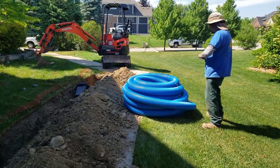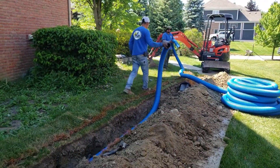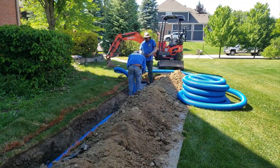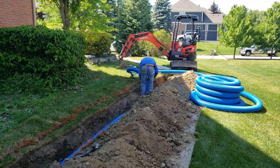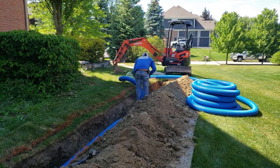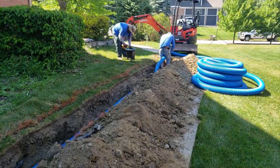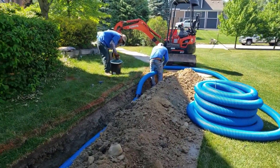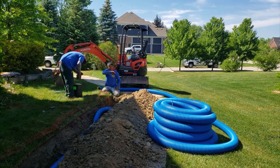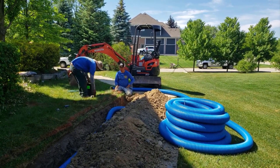This is a solid yard drain pipe. We have the high octane Royal Blue, which comes in solid or it comes in a French drain pipe, which has a very open inlet of eight slots per valley and takes in more water than any other pipe in the world. We're using the solid on this job. This is a roof runoff. I always get people in the comment section saying, 'Hey, where's the stone? Where's the drainage fabric?' This is not a French drain — this is a roof runoff system. All this pipe is solid.